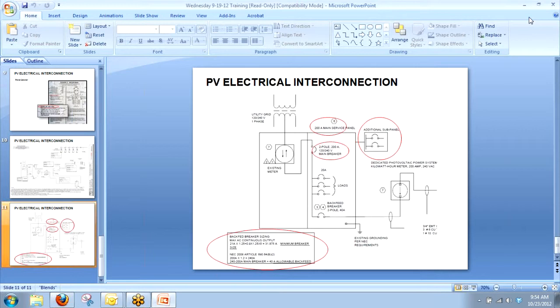If we have four renderings in four different places, I need to know where this ground mount is going — whether you put it in a note or circle it in a picture. I need that information: where it's going, which way the ground is sloping, and pictures of that ground. Is it just soil? Are there boulders? Is there grass five feet high? All this stuff we need to know — and that's just for ground mounts. We haven't really touched on ground mounts much, but lately we've been selling a few of them. So that's really important: give us the location, which way the ground is sloping, and at what angle — from a free inclinometer app, or give me the rise and run.